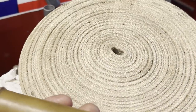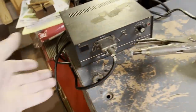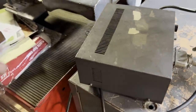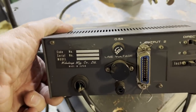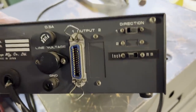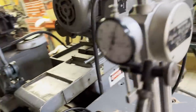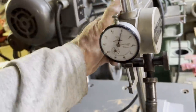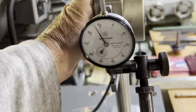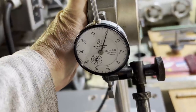This is a two-foot height gauge — a Mitutoyo — which I've been eyeballing for a few years now. It's obviously an older model, but the price came down to where it was kind of nuts not to. I did plug it in and it seemed to work. Here when I got home I just clipped on a dial indicator right onto the beam — a dial indicator that I know is in pretty good shape — just to see how close it is. For the kind of work I do, I think it's going to be just fine.